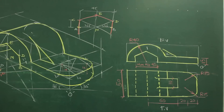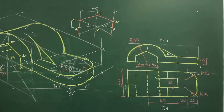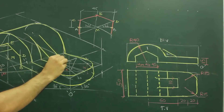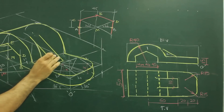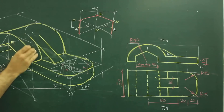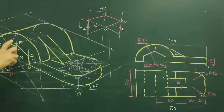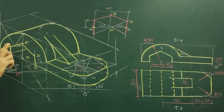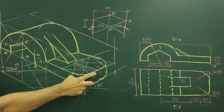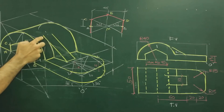This I need to erase. And then after that I can draw. Width of the rib is 10, so I can draw a parallel line from here, extend 10 over here, and again draw a parallel from here. So I got the rib. Once again I will explain the rib. Since we have drawn this radius from point 1, you go inside by 20 and draw an arc. Extend this point — this distance is 40. You mark 40 and from there draw the tangent. So you get the rib.